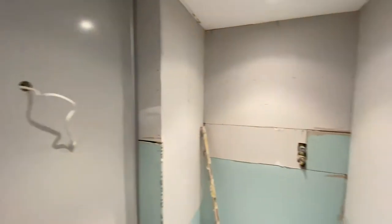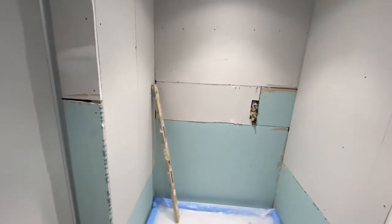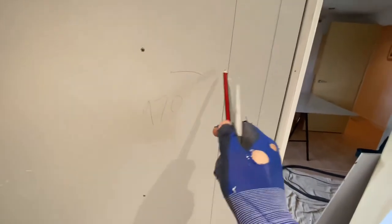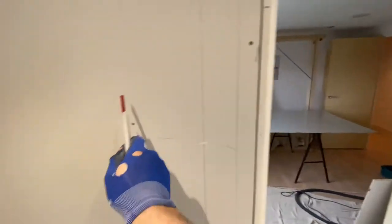Also what I'll show you is, in this bathroom, obviously we've got this light grey panelling, and when we go to the shower area, it's going to be a real dark slate grey. And obviously there's going to be a join there where it goes from dark to light. I'm not going to be able to tongue and groove it, because I've started from around there. If I tongue and grooved it, it would end up over here. So it's going to be a straight cut.